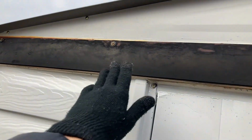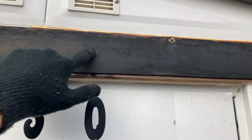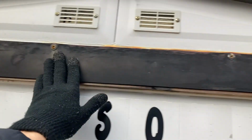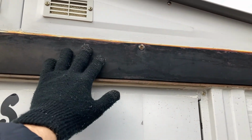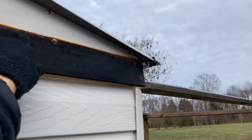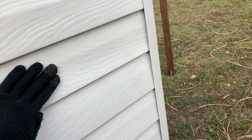So with the whole roll-off roof build, there's a gap about that high. So I bought this 3-inch long neoprene rubber stripping and sealed it off on all sides so no weather or rain can get in at all. I've siliconed it. I've used a lot of silicone on this build. You can see the silicone sucked up the color of the stained wood, but that's all right. So yeah, it's pretty sturdy, a lot sturdier than any kind of plastic shed you could get. It's all screwed together.